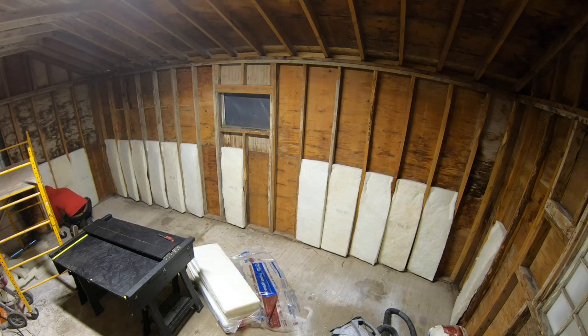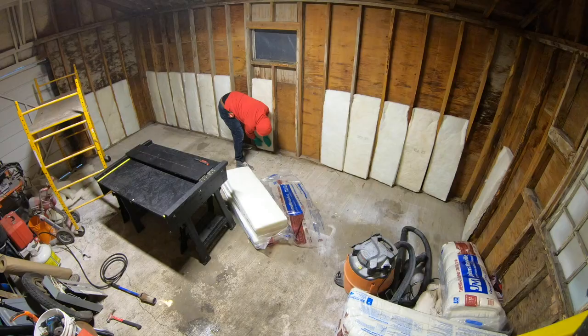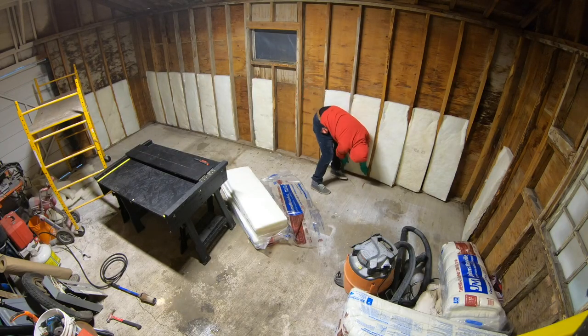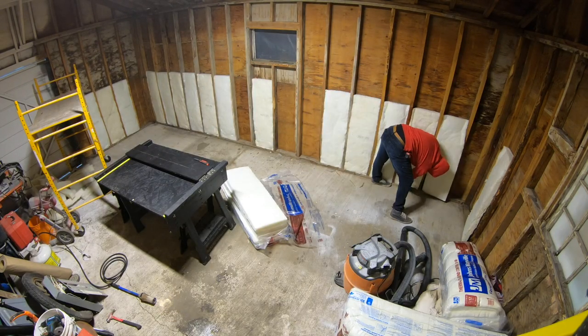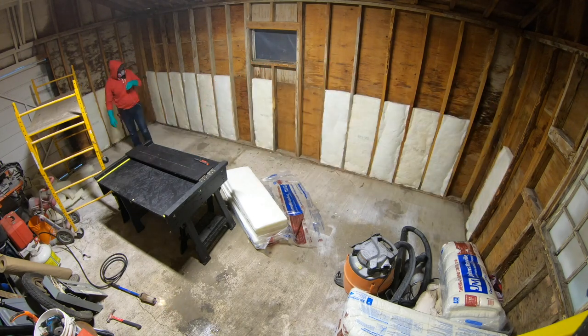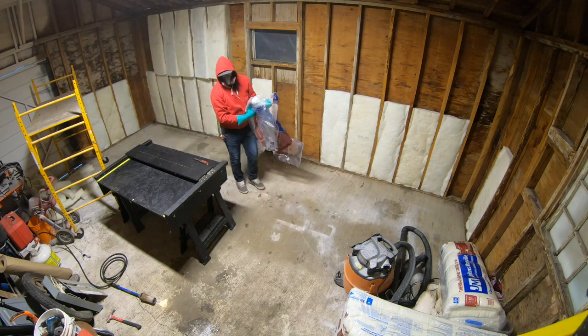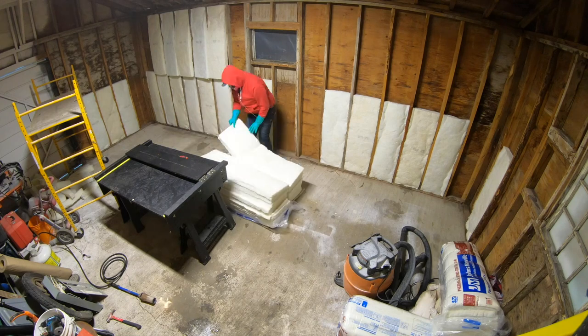After I have all the no-cut bottom bats in, I will go through and insert the bottom by slightly bowing towards me and inserting both bottom corners. Clean up the sides, always keeping the bat bowed towards the room. Inspectors are looking for a nice, full, plump look, not jammed in all ununiform. Take your time. Now I will start the no-cut top pieces using the same method as the bottom pieces.